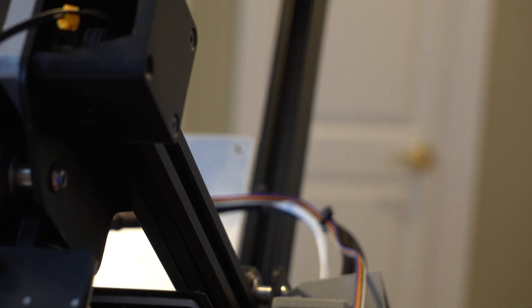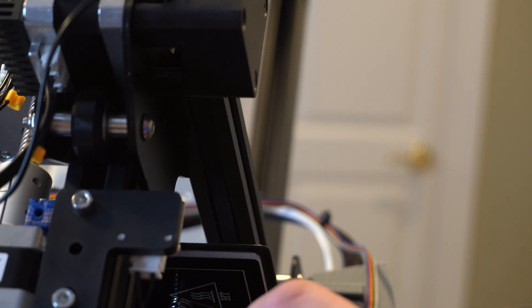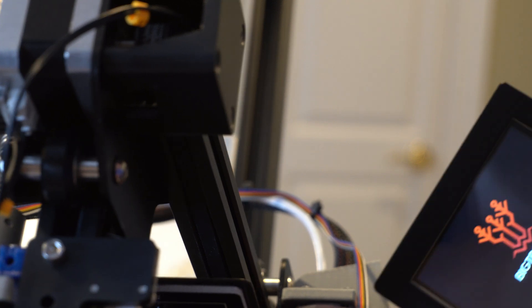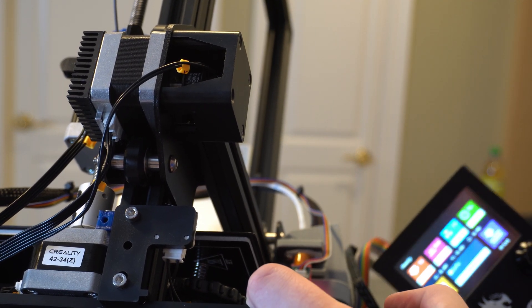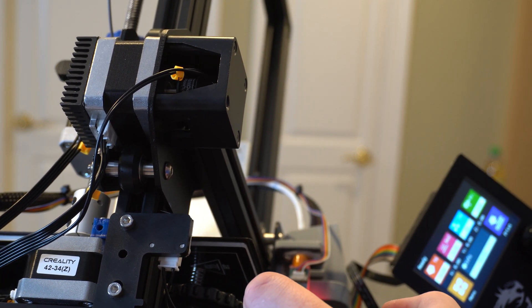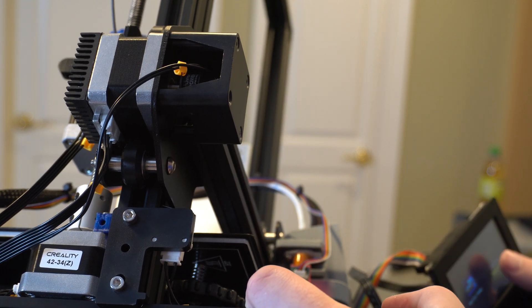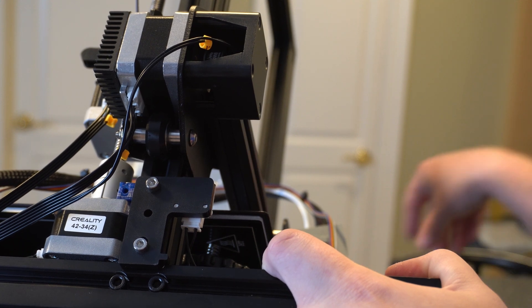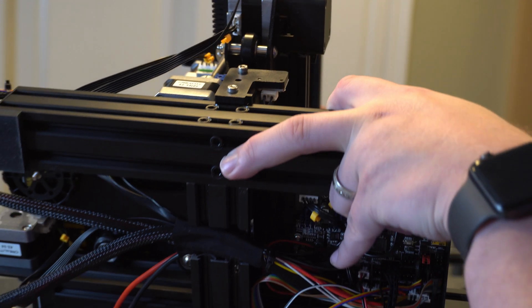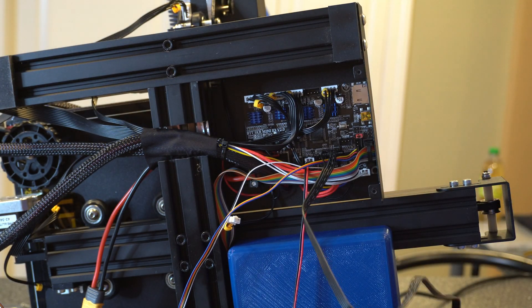If we give it some power we should get everything to power on correctly and look normal. So let's make sure that we're good before we actually start running the wires and closing things up. Now if you are going to test it this way with everything opened up, make sure that you're not touching any of the components — that can end quite badly. You can see the display came up here and it shows ready, so we're good to go. If we hold down the control dial we should get the choice to go between touchscreen and Marlin mode, so we'll go back into touchscreen mode. So that shows me everything is connected right. I'm going to power this back off and disconnect the board again.